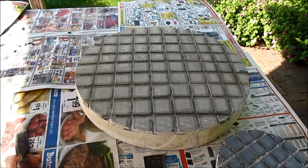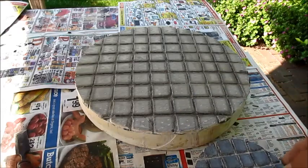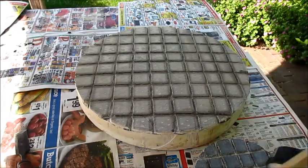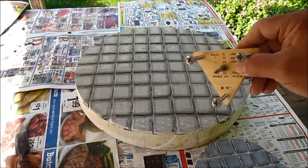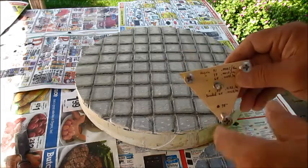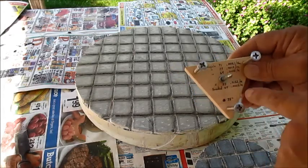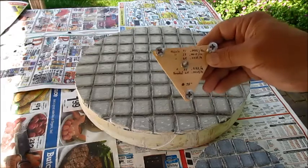You have to have the right hardness of pitch for your laps, and the right hardness at the temperature you're working at. To measure the hardness I made up this little gauge — basically a dial indicator with a tip that I brought down to a flat point, maybe 50 thousandths on the end. I measure different pitch hardnesses ranging from Gugolz 91, which is hard, all the way down to Swedish pitch 64, or even Gugolz 55 which is pretty soft.